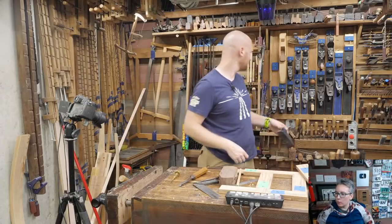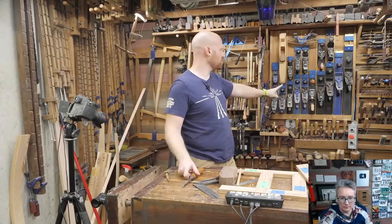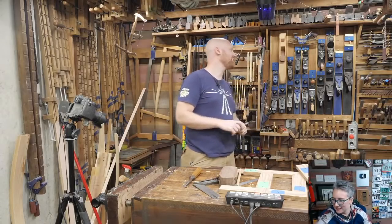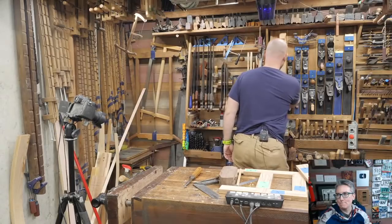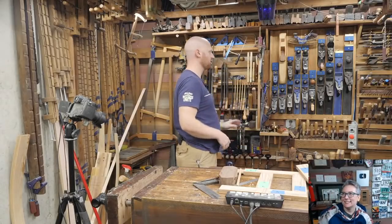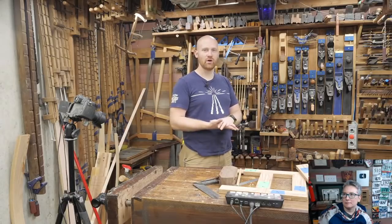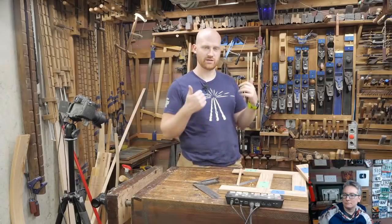Annie Morin asks: why are James's planes blue? The planes I have here that are blue — I did a complete restoration on them, they were past the point of no return. Whenever I strip a plane down for my own use, I paint it blue because I like blue — blue makes me happy. I do have several videos on putting original japanning on, since most old planes are black from japanning, which is like a lacquer made with BLO, turpentine, and asphaltum.